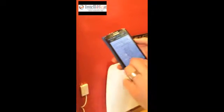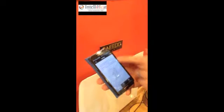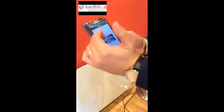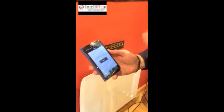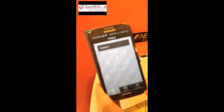That there is the code for the receiver — RF6. It's written on the receiver as well. As long as that code comes up you can use any one of these products. Go into the heating. This is where we choose the network — you can have up to 32 heating zones if you need to. We're just going to select network one and start searching. What it does is search until it finds that product. Product one has come up — it's found it. The light on the receiver has stopped flashing.